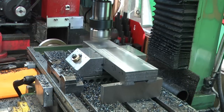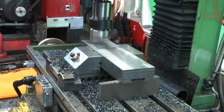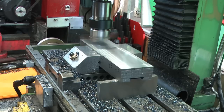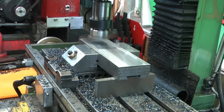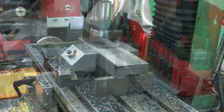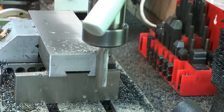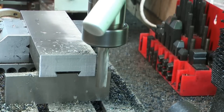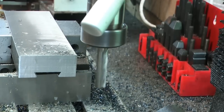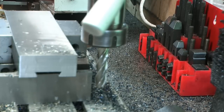So the final fly cutter cross-surface pass, we're down to 28mm. Happy days. I think I'll machine this end square now, giving myself something to register off for length. I need to decide on the lengths.